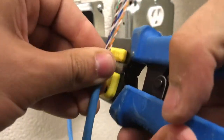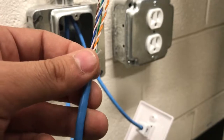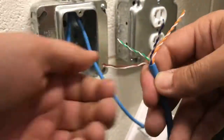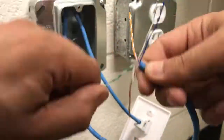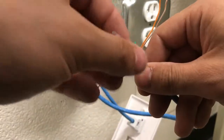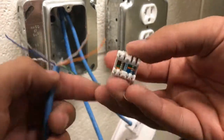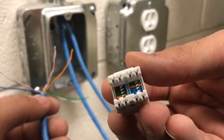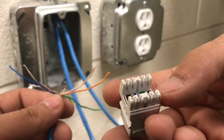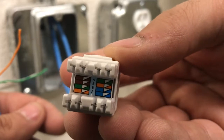I'm going to use the scissor part of the crimpers to cut this piece off. You don't have to, but I do it so my work is a little bit easier and that string is not in my way. Next, you want to untwist the wires. Once we have the wires untwisted, grab the keystone and pay close attention to the colors on the back of it, because the colors will tell you what type of ethernet connection you're using. Most commonly used worldwide is the B type, which you can see here — there's an A and a B type indicated.